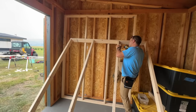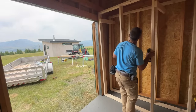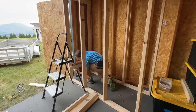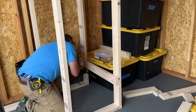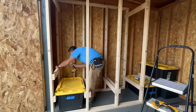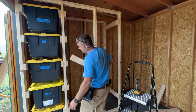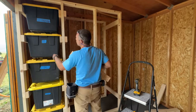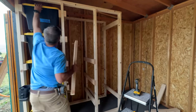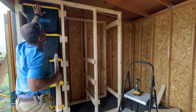The next step is to connect the front wall to the back wall using those horizontal rails. Stand up the front part and attach a couple of the rails from front to back so you'll have a stable unit to start working on. Use 2.5-inch long screws to attach the rails, then connect the rails at each of the marked locations. You'll use ten rails per column if you use five bins, and thirty rails total if you're doing three columns. I put in a few bins already to make sure everything fit and there's a nice gap between each, with a little extra room at the top so you can angle the bin in more easily.